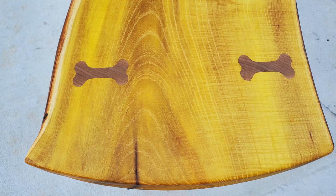Somebody asked if the joints were dog bone mortise and tenons — did I do that for visuals or for added strength? I did that specifically for visuals. I think that's just more interesting than a simple slot shape you would see in a through mortise and tenon joint created with a router. Just looking at it, it catches your eye a little bit more. The intent was mainly visual interest. That being said, the more you think about it, it has a little bit more surface area, maybe a little bit more conflicting geometry.